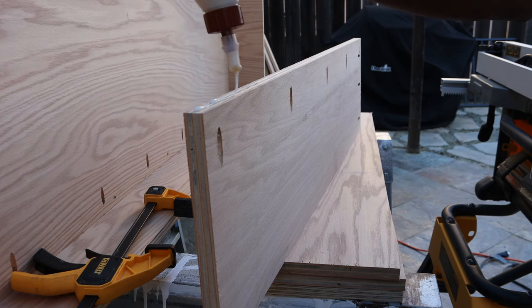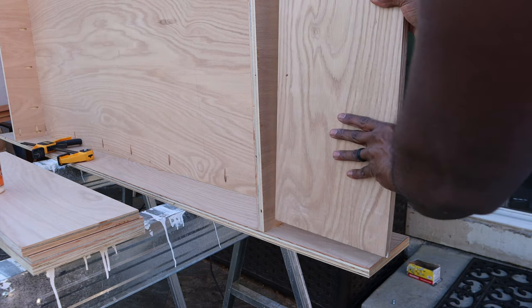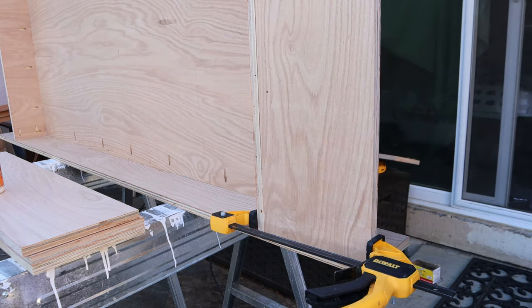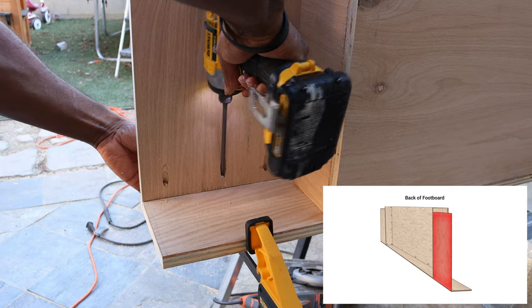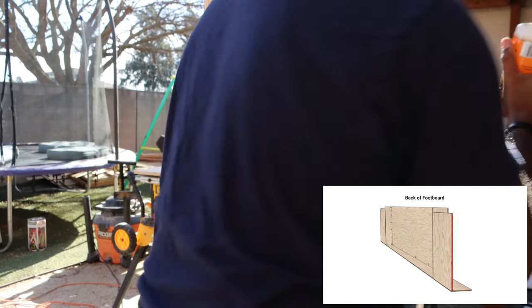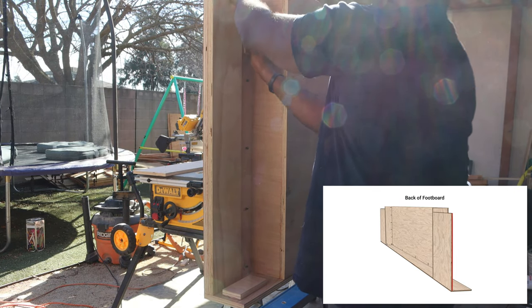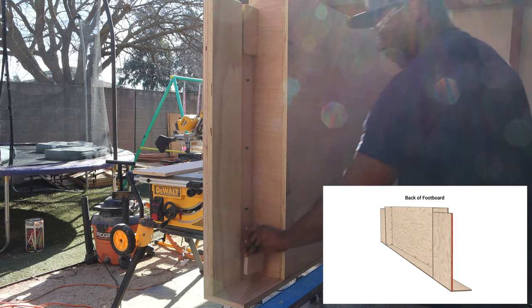For the side panels, I used wood glue and clamps wherever I could — I don't know what I would have done without them on this project. I used clamps to stop the side panels from shifting as I was screwing in the pocket hole screws from the front side of the panel. Each panel has three different layers, each three quarters of an inch thick, and for the center layer I used scrap wood instead of a full sheet of plywood. Attaching the scrap pieces was straightforward — just wood glue and pin nails — then I did the same thing for the front panel.